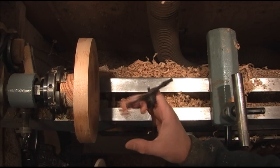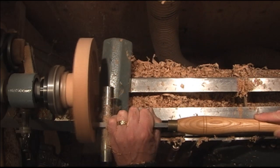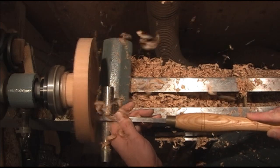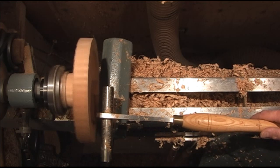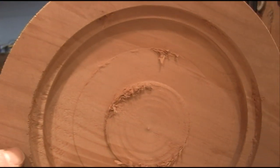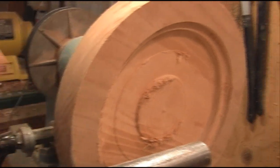This is a little bit different than making the mirror compact. Just go ahead and come in probably a quarter of an inch, and then you leave a lip in there and clean this out. So whether you are putting a plate in here or you want to do a picture, that way the glass and the mat will have something to rest up against. This is the diameter of the plate we're going to put in here, and this is the lip where the face of it will rest against. Then we're going to go straight in here and come in from the side and part it off.